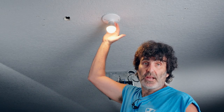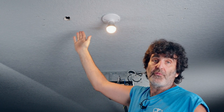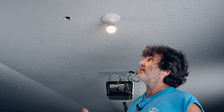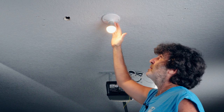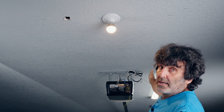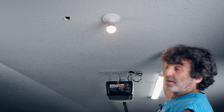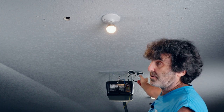On this job we're going to take down this ordinary light fixture and replace it with a four-foot LED shop light. Very easy job - it's just a matter of swapping the lights. In addition, I want to pull a wire from here and run it over to a second box, and that's going to power two LED shop lights. These lights can daisy chain together without visible wires, so I only need one location to power two lights.